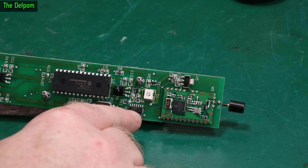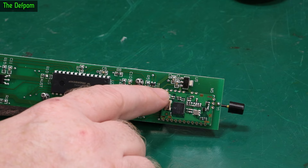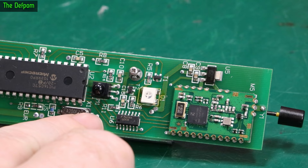I think this one is like the medium age type, not the newest one. So it could just be an issue with the solder joint in these castellations — a bad connection. It could be the voltage regulator giving trouble. It could be a data problem from this chip here, or an issue with this chip itself, because it looks like it's sending data up here.